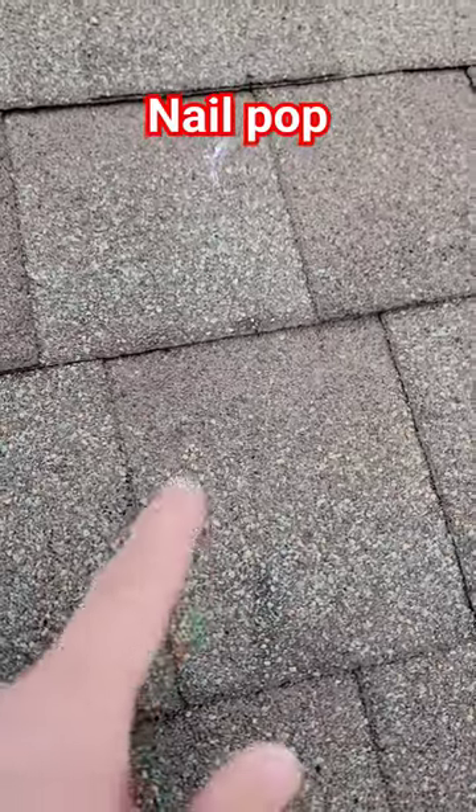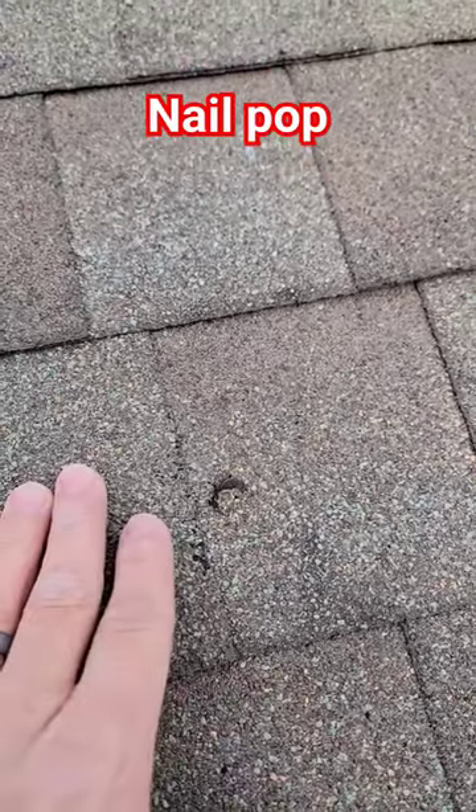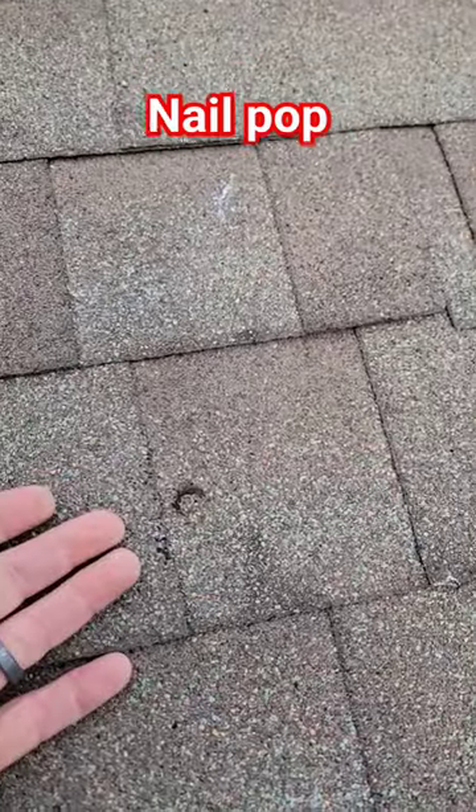Because we have rain coming, I'd recommend spotting this — and they're actually all over the roof. You should replace the shingle, but because they're all over the roof, I'd recommend replacing the roof sooner than later.